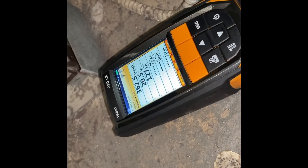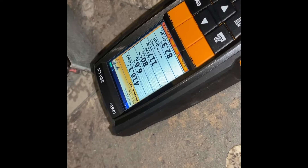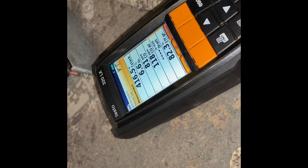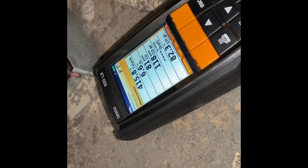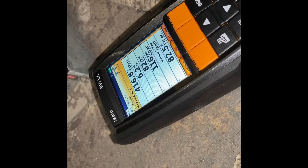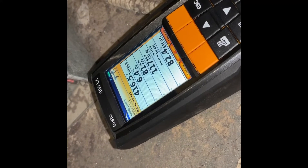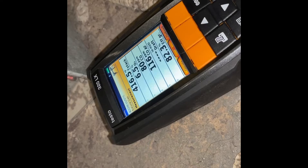Let's turn this bad boy back on. We've got to adjust the gas valve. What should my O2 percentage be on an atmospheric boiler? Between four to nine percent. We're at 6.2 - 6.3. Our carbon monoxide is coming down - a little more adjustments to go on that.